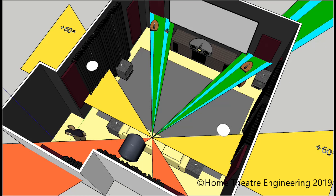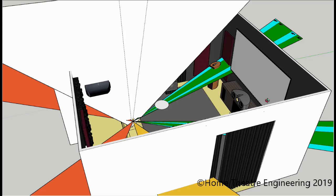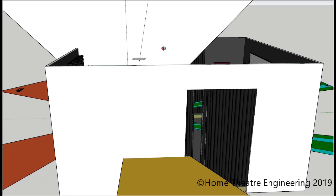You'll notice your front speakers are also well within the specification range. Your screen — I would like it to be a little bit wider, but with the distance of your projector and the screen ratio of the projector, it's making it difficult. Plus we have to fit everything else in as well, so that's about as big as we can go at this point. We could stretch it a little bit and certainly discuss that. We've also calculated out the Atmos speakers. They sit at 10 degrees off vertical for a single set. These two lines here are where you would have twin Atmos speakers, but your room doesn't work super well for that because this wall is way out behind you. So I think a single row of Atmos speakers is going to be the best option. There are ways we could put some speakers in the back here and angle them to simulate being further back, but it depends how important that is to you.